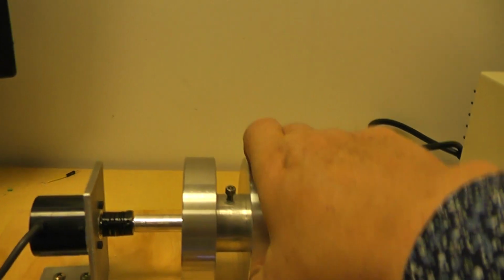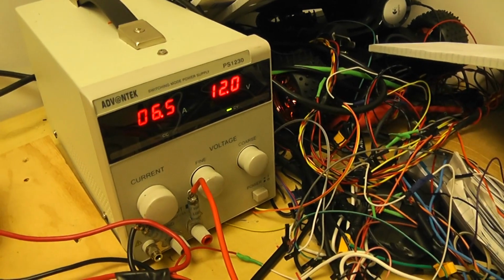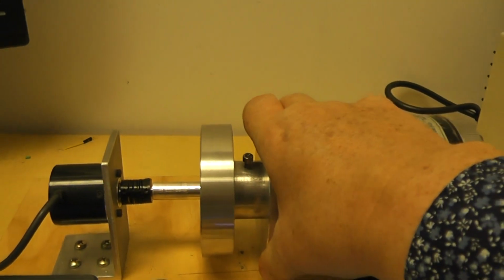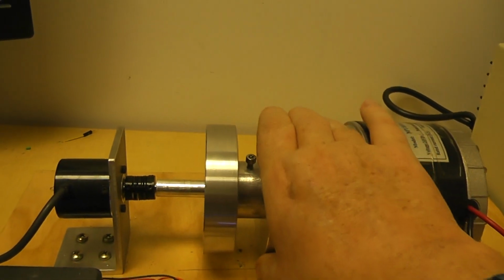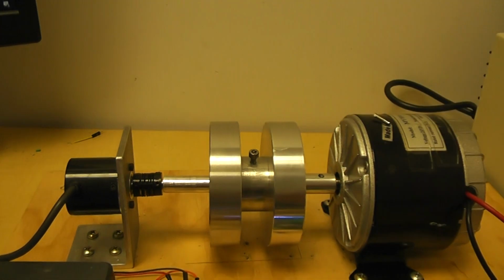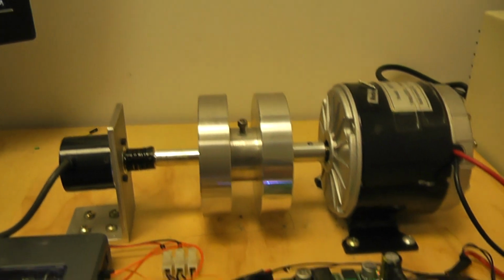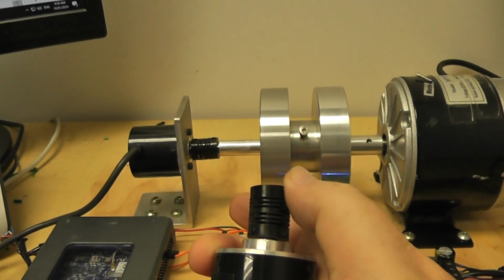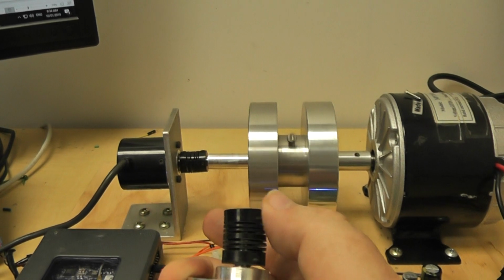This torque that's holding it, I can try and, you can see the current trying to go up. It goes quite high, because it needs current to create torque. So when I introduce the disturbance, it's drawing more current to keep the position in the right place. And that's all integrators doing that, and phase advances keeping it stable. So that's why I can do this. And if my stability is not right, of course I can adjust it and so on.